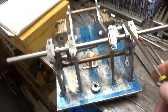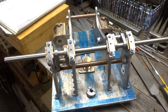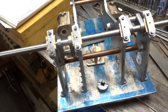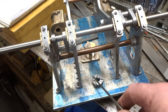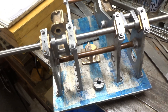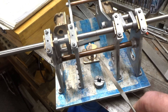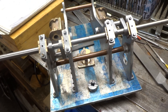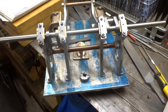If I'm to keep to the 90-degree crank position — which is what I think I ought to do — it's clear that the dog clutch can only engage in one position, so that the cranks when going forward are at 90 degrees. Which is why I've only machined three slots, so that this thing will only engage in one position. Am I right? Don't know. Have I gone nuts? Not sure. It's causing quite a bit of work actually, but it's quite interesting in a funny kind of way.